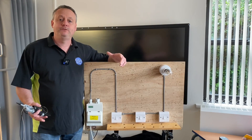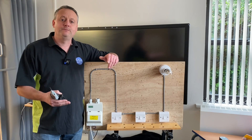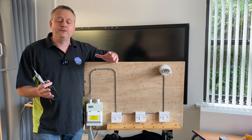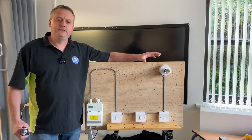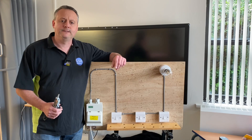I'm back with my rig in which I showed you how to do the feed-through switch method of wiring a lighting circuit. If you haven't checked that out I'll leave a link in the description or the eye above my head, because it's really handy when you're looking at AM2, AM2S and AM2E for the method of wiring two-way and intermediate switching to control a lighting point. That may be something you haven't come across in industry — you might have been using the two or three plate method to wire that lighting circuit.